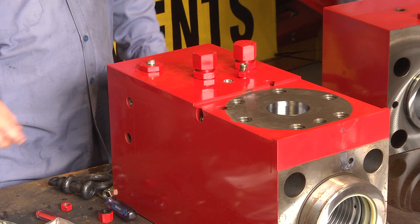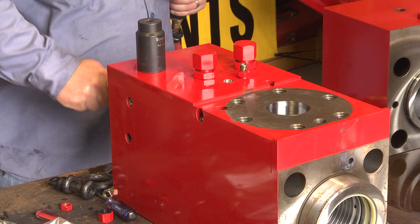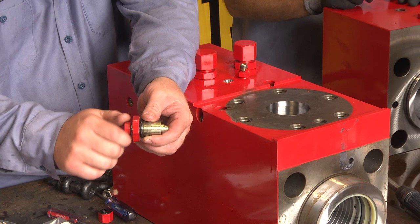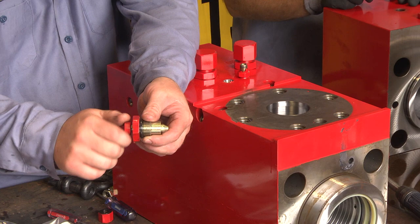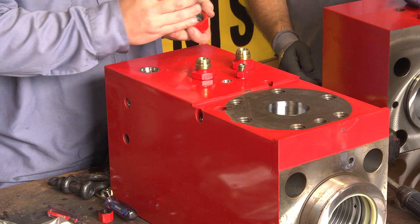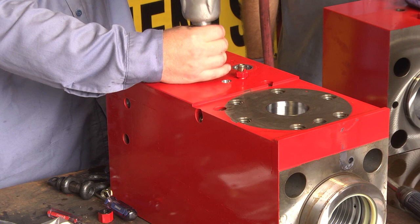Remove the larger nut, then remove the o-ring. Those must be inspected for damage, especially at the bottom of the needle, and the o-ring will need to be replaced. Once you have removed your BPM adjuster, now we must remove our hose adapters. The hose adapters have o-rings on them as well, so inspect those o-rings as they will need to be replaced.